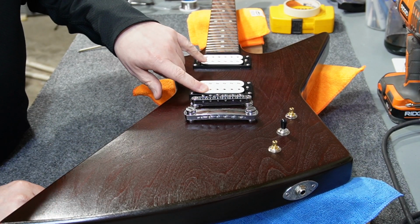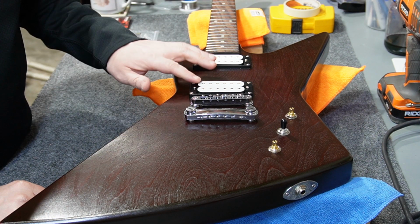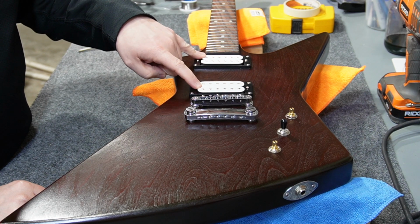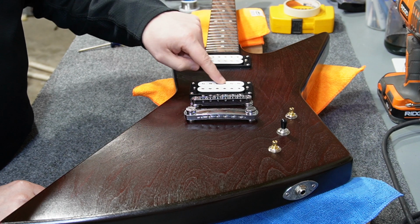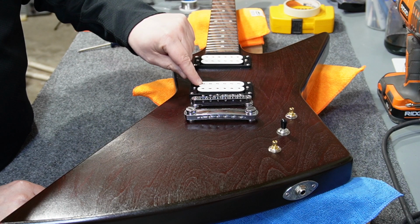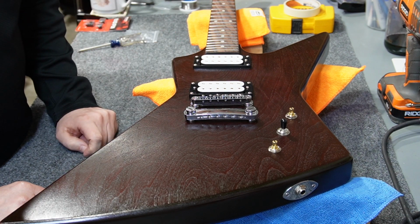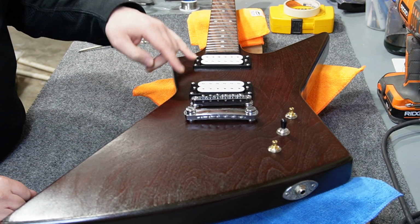These actually are really much nicer humbuckers for just a little bit more money. These are the Fleor humbuckers. They're PAF copies. They kind of look like Seymour Duncan wiring. They've got 4 conductor wires. They've got adjustable pole pieces on the outsides here. They've got really nice magnets or pole pieces here with concentric circles on top, sort of to avoid corrosion or scratches. They've got long leads, really nice hardware, and they're wax potted. So they've got a lot of things going for them. Just in terms of build quality, they are far and above what came with this kit.